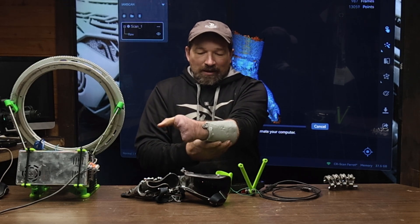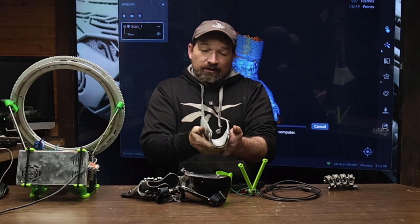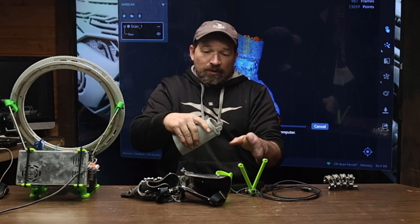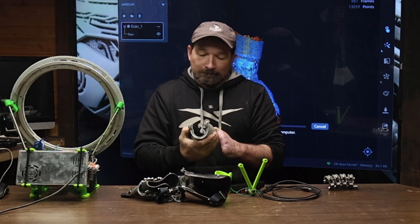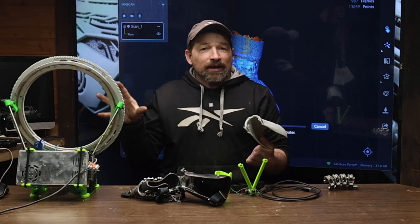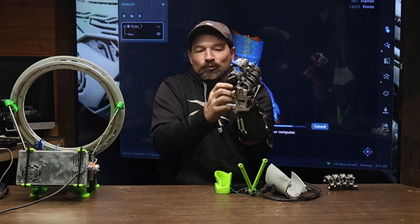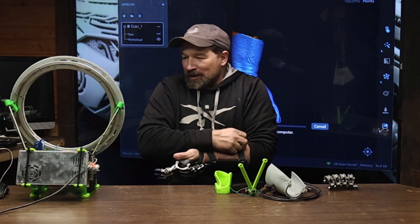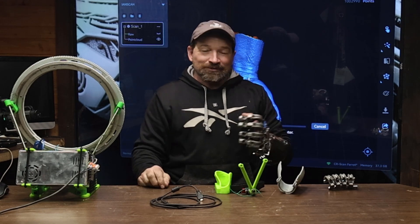I was just able to print it up. Next time I'm going to print it with some different supports. Being that this is ABS, it spread a little bit. I think next time I'll do it with this face down on the build platform so the layer lines are oriented this way rather than this way — just something new I'm trying out. I thought you guys would enjoy seeing why it was such a neat thing to figure out that I could do the scanning directly to my laptop, as opposed to running it through my phone or through a wired connection. Let me know in the comment section. Thanks for watching. Bye.